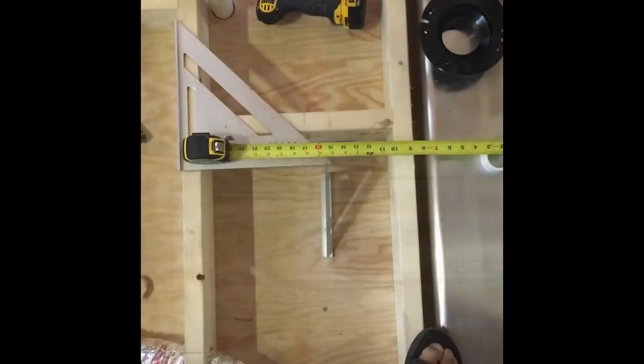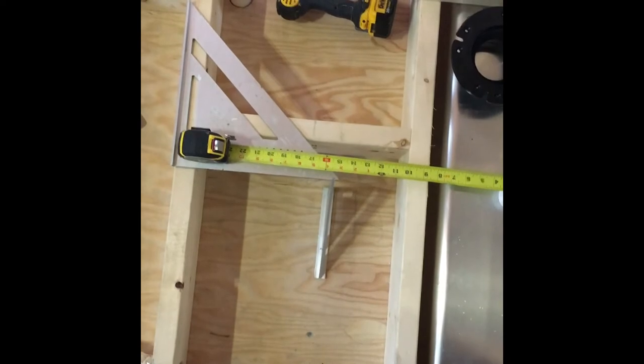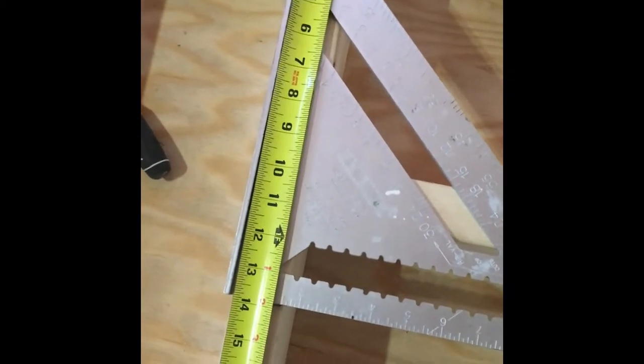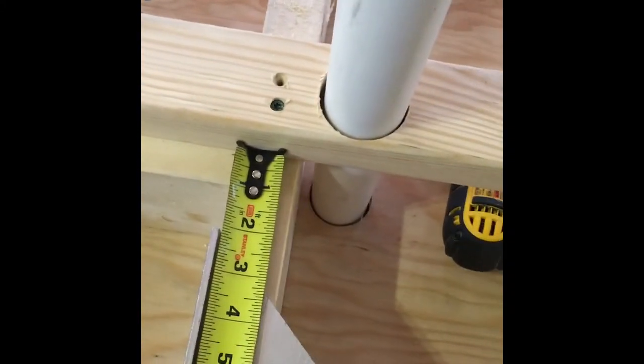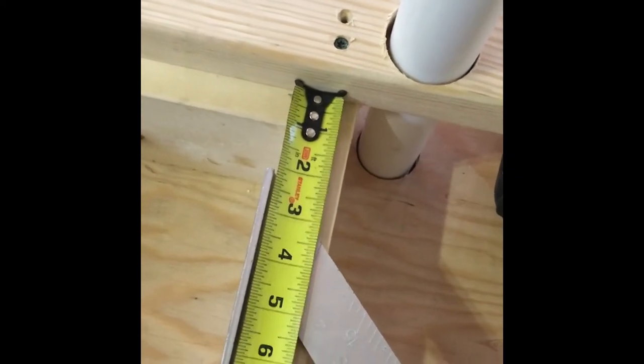In case anyone's interested in how you find the center of something — I'm looking for 14 inches off that wall, which at the end of the day will become 13 and a half because on that wall will be a half inch of finish: quarter-inch Luan and a quarter-inch of tongue and groove. So that's a half an inch, and we come to 14.